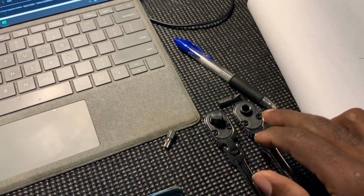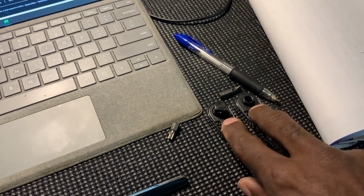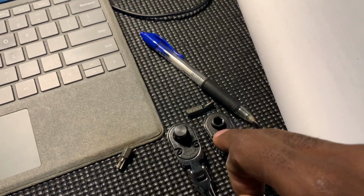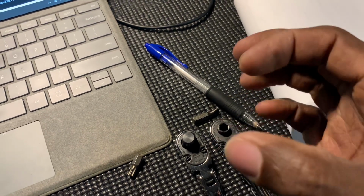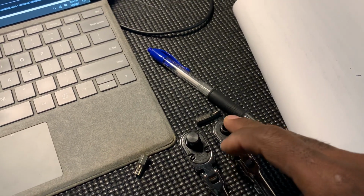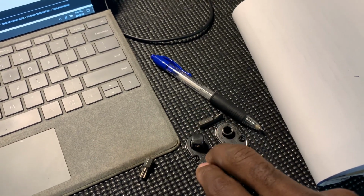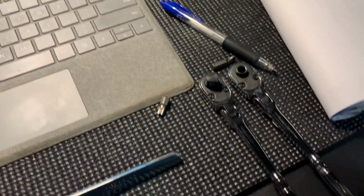TF72. And that's because the pawl and all of that, the spring, the selector, are going to be the same for both ratchets, but the only thing that's going to change is going to be the plate, because obviously the diameter needed to incorporate the anvil is going to be different from a 3/8 to a quarter. So your plate will be different, and obviously your anvil in itself will be different. So you can easily order the 3/8 drive gear and plate from Snap-on and swap them and kind of jump around. And it's very, very easy to do.